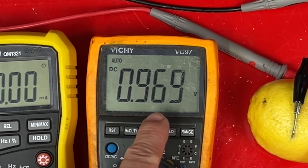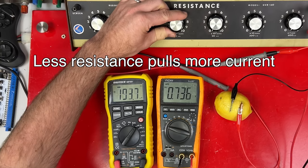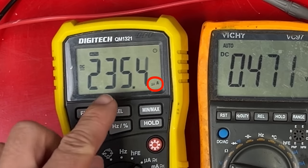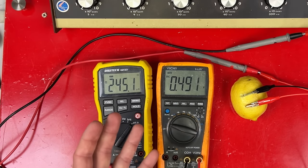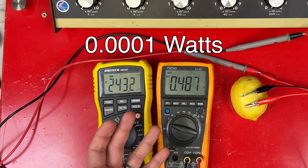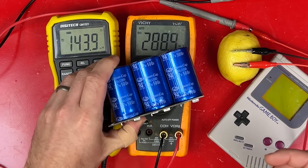Now it's time to measure a lemon. With nothing connected to it we get nearly 1 volt, which is actually pretty good — a double A is 1.5 volts. I can set this to drive this lemon as hard as it goes. The less resistance I give it, the more the voltage drops off and the more the current increases. However, this time we're dealing in microamps — I've never even used this function on my multimeter before. Multiplying these numbers together I get 0.0001 watts. That's going to be two and a half thousand lemons to run a Gameboy. I'm not going to do that. I reckon I can do something better, and that's where this comes in.